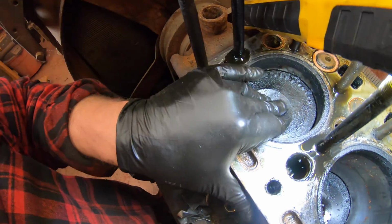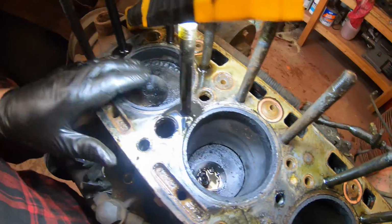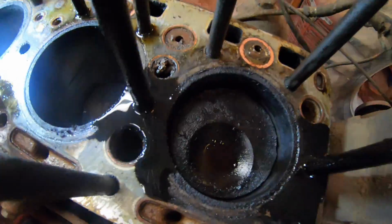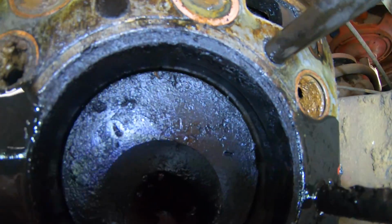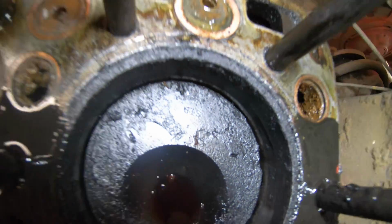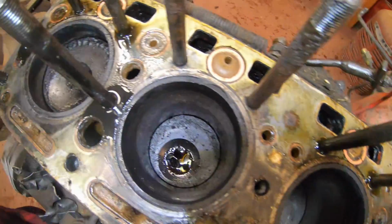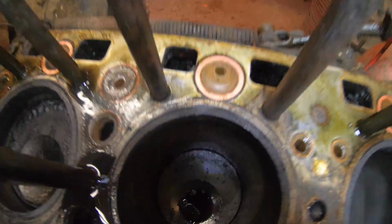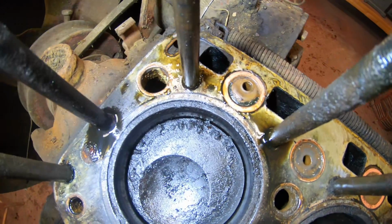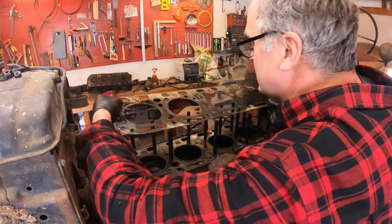The pistons, you know, I've seen worse. I've seen them wiggle in the bores, and these appear to be pretty tight, but again, I'm not going to know until I pull the pistons out and look at them. One thing that concerns me about the pistons is on 3 of them I see chips on the side. Here, let me get the light. There's a little chip right there at 3 o'clock, and on this one there's a chip at 11 o'clock right out of the side of the piston where it meets the cylinder wall. There's one there again at about 10 o'clock, little chip. I can't see on this one because it's so heavily carboned. I don't see any chips. So I'm going to have to take the pistons out to really know what's going on and see if I can get away with just a ring job on it. Let's pull this head gasket and see if that tells us anything.